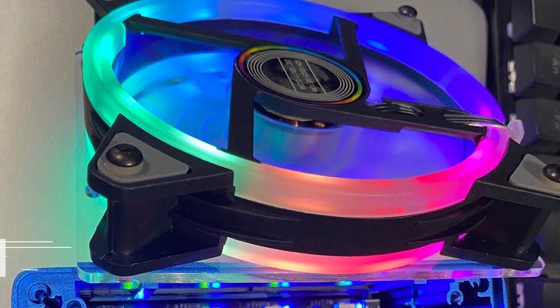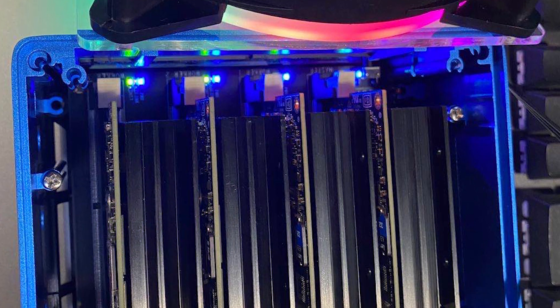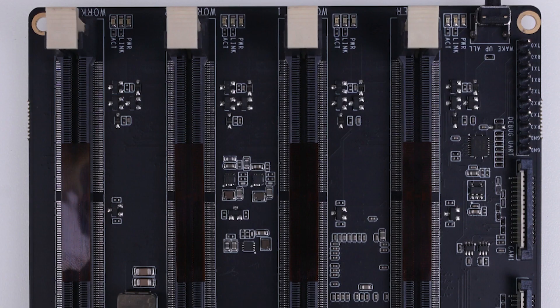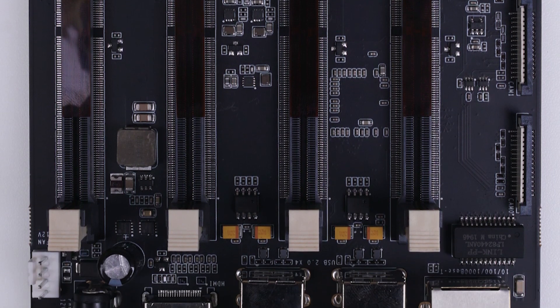Next one is this thing. It looks like Jetson Nano, but it actually is not Jetson Nano. This thing is called a System on Module. The normal Jetson Nano you saw is the System on Module on the carrier board designed by NVIDIA, but this carrier board is designed by Seeed Studio. It can carry at most four Jetson Nano SOMs and can also support Xavier SOMs. We built this because we noticed a lot of users are building clusters using single board computers like Raspberry Pi or other SBCs, and also many people bought Jetson Nano for learning or other purposes and have a few left over — we wanted people to make full use of them. So we made this carrier board to help people build clusters easily.